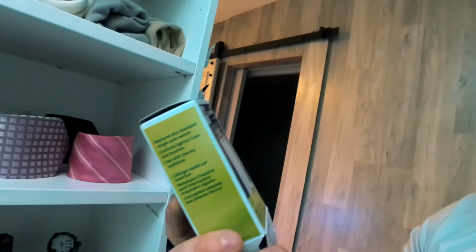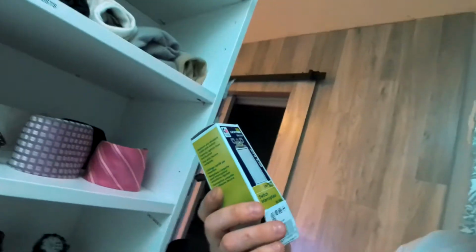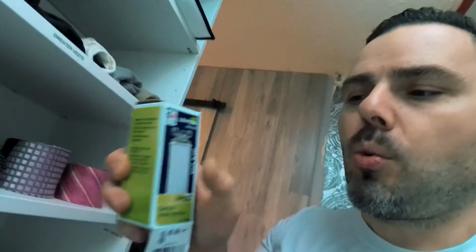For light switches, we're only focusing in on these ones. These are the Levitons. They're like $2. This is a switch or an interruptor. Interruptor essentially because it's interrupting the power that is traveling to the switch. So when the switch is down, and these are, by the way, marked top on top, when the switch presses down, that's cutting off the electricity and opening up the circuit, not allowing it to continue to the top.